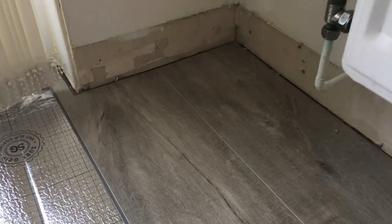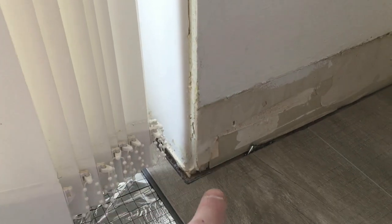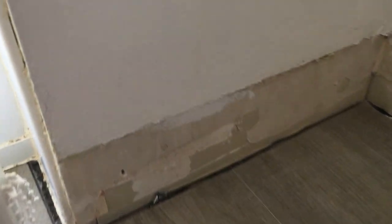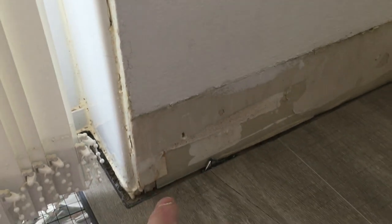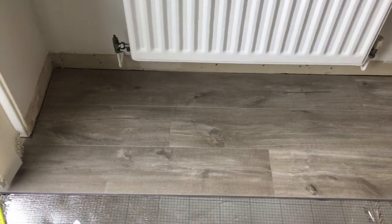That's the first couple in. Here's the bit we just cut - this will all be covered with a skirting board anyway so not the rough edge. We always maintain a 5mm gap all the way around for expansion. I don't put any wedges in to begin with just so we can move the floor about.